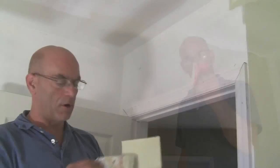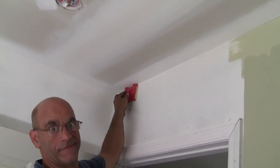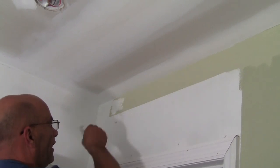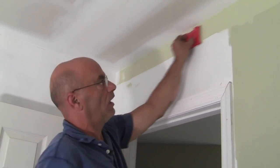Now I'm going to show you the edger. With our pad soaked with paint and the wheels clean, place it right against the wall, make sure the wheels are touching the ceiling, and simply go across like that — nice straight edge. You can see a few little spots there, mainly because the paint still needs to soak in more. It's pretty simple and easy, and if you're doing a whole house it can go a lot quicker, though you have to be careful. You can use one of these to make your straight edges or use a paint brush — I'll take one of these.